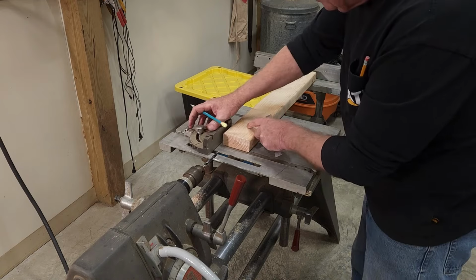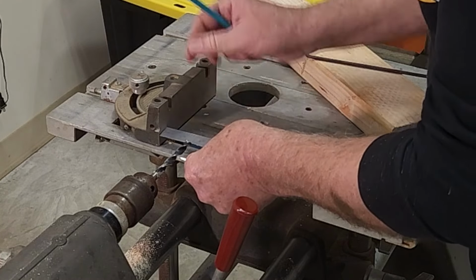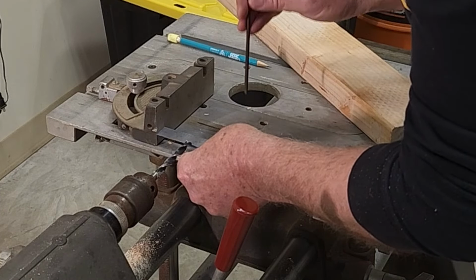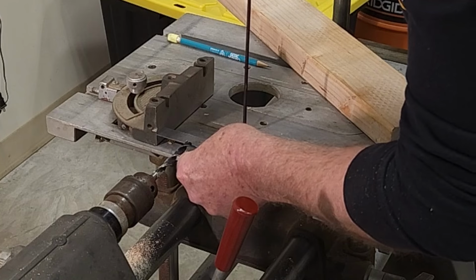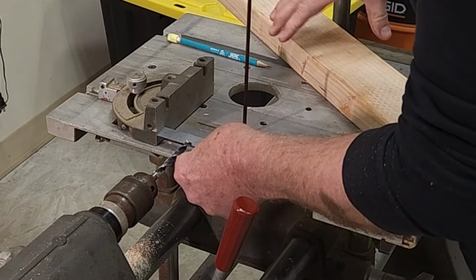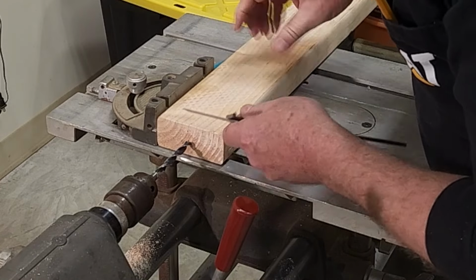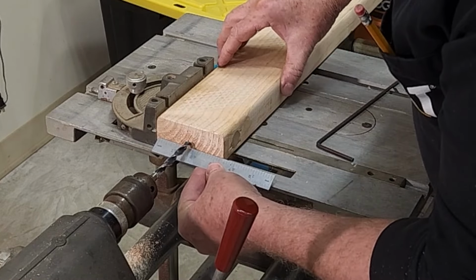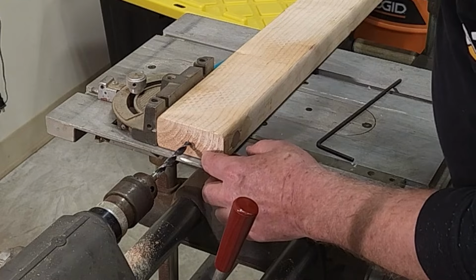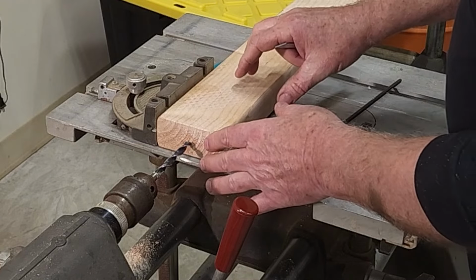The Shopsmith tool has a nice feature that you can actually lock the miter gauge. So I'm going to set this to 1¾ inches. That should be the center of the 2x4. So when it goes in like this, that'll be the center location. So that should be centered right in this way. And we already have it centered up and down at 3/4 inch. So we haven't moved anything. So right now as it is, everything is set up.